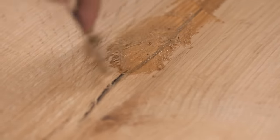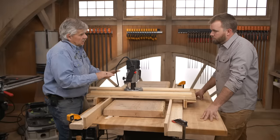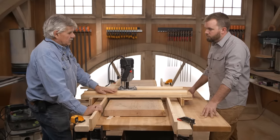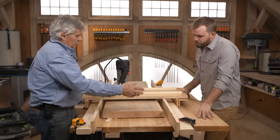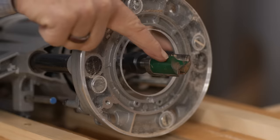While the epoxy is curing, let's flip it over and work on the bottom. Now we're all set to make the thickness equal over the entire run — make the top parallel with the bottom. The best way to do it, because of the size of this, is with a router sled and a router bit with a couple of guides to ride it on. Another option would be a thickness planer, but we don't have one — we'd need like a 20-inch planer. So we've got a heavy-duty three-horsepower router with a straight cutting bit. Light passes back and forth and we'll work our way until we're all even.